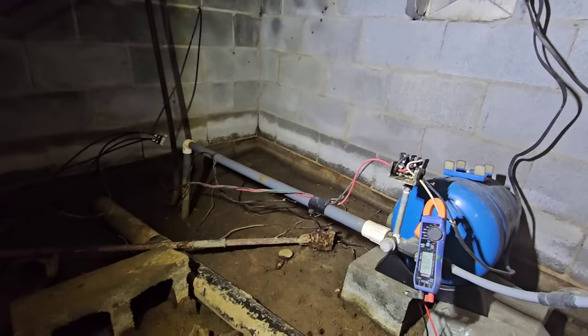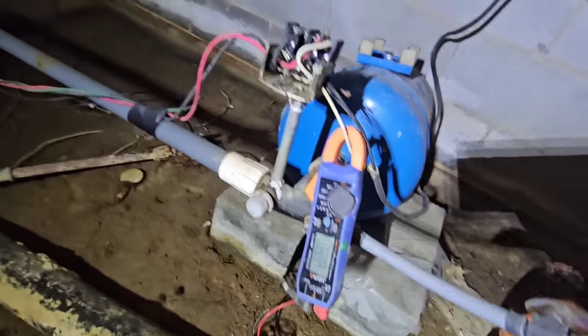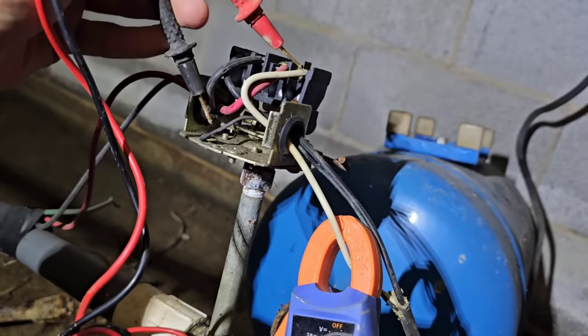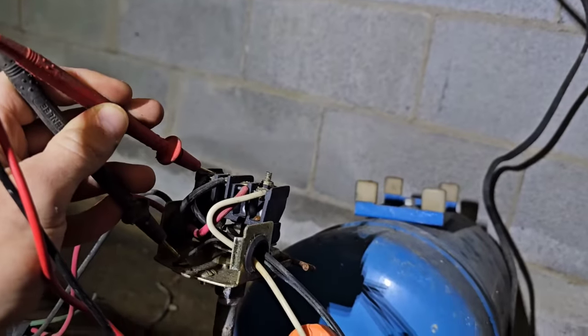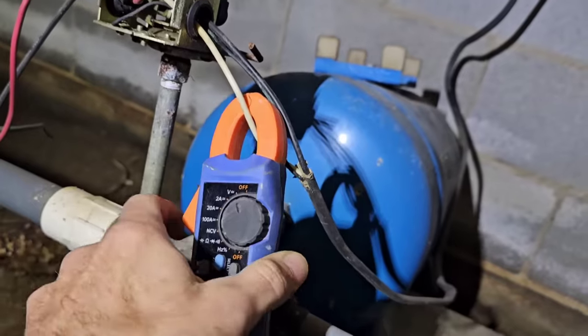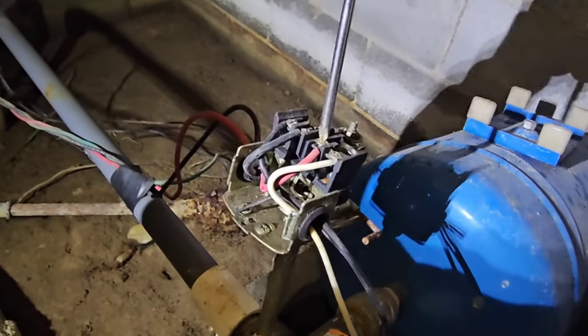I'm under the house now. They're doing a full remodel so a lot of the stuff has been removed. The first thing we want to do is make sure there's no power on these wires. We're going to test it to ground, make sure nothing crazy is happening. Okay, nothing there. Moving over to the other side — point one two, so not even a volt. Good. Now we know definitively that power is off, and we're going to remove the wire that feeds power out to the well pump.